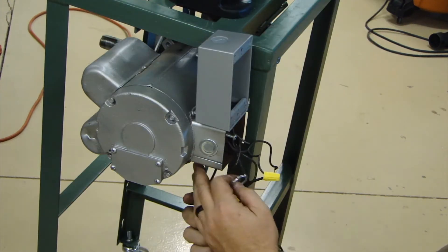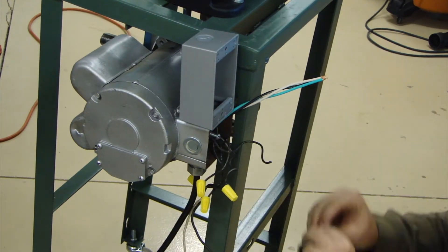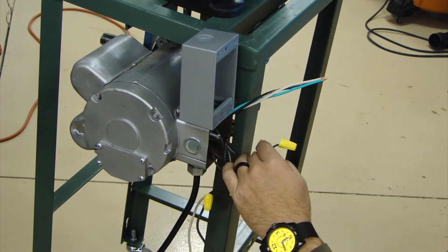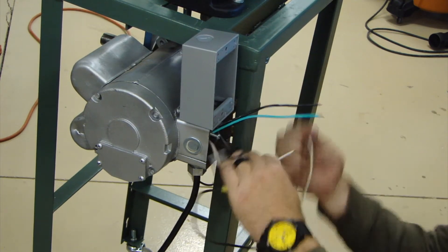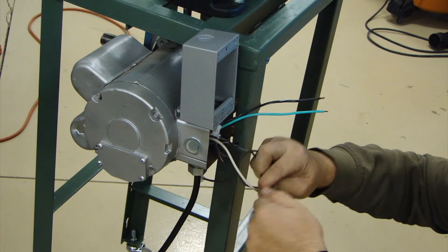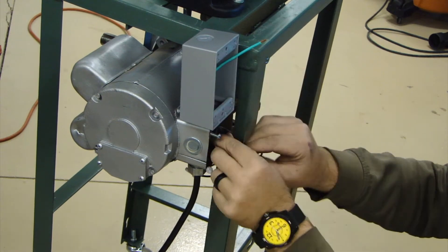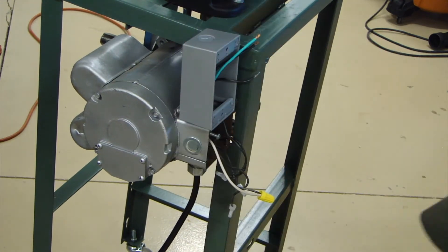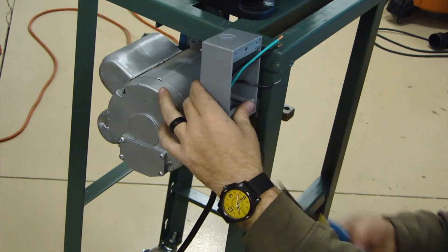You can see the single gang electrical box here. What you can't see in between there is a piece of hard conduit — essentially just a half-inch nipple with some conduit nuts on it in between — so that's a hard steel connection between those metal boxes. This motor is designed to run in two different directions because it was for that door, and it can also run at 115 or 230 volts. There are some extra wires in there that I'm not using because I'm only using this in one direction and only at 115 volts. So cleaning up some of the wiring.